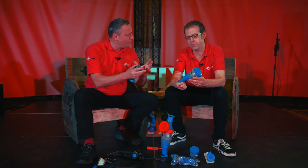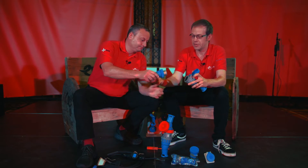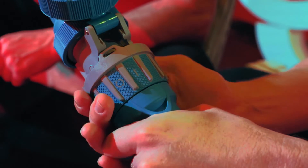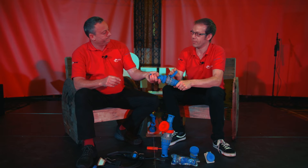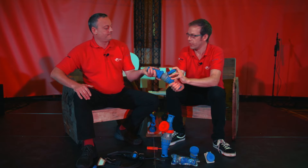The advantage of not being able to plug in until you've activated the switch is that you can't plug these in or disconnect them when the switch is operated. So when it's on, you can no longer remove the plug. Because if this is connected up to inductive loads, you do get a lot of sparking and arcing when they disconnect, so we want to avoid that.